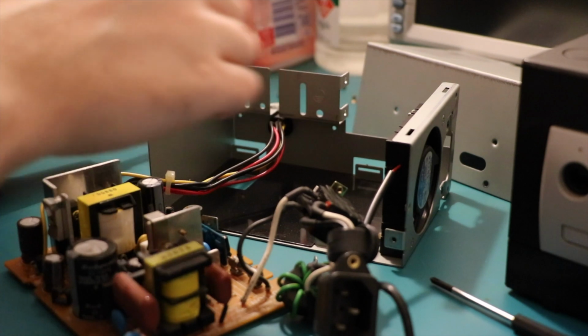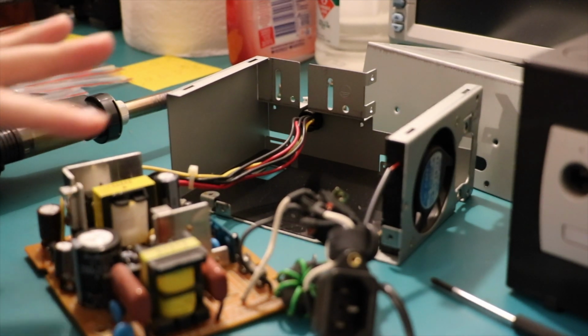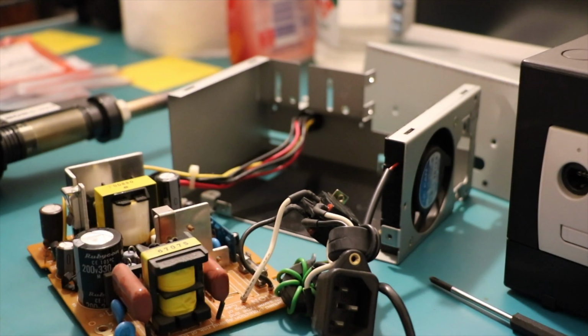10 volt 6800. I have tried to stick with the original voltages as much as I could in case anyone repairs this. In case 1, I repair this, and 2, if in the future someone else needs to repair it, because I didn't repair it properly, or it's been 20 years, and they want the values, and the values are all mixed up. Because for example, I could put a 16 volt 6800 instead of a 10, and the next person along puts in a 25 instead of a 16, which was instead of a 10, and eventually things start to get a bit odd. I'm not quite sure what effect that has, but I'm sure it's not good.